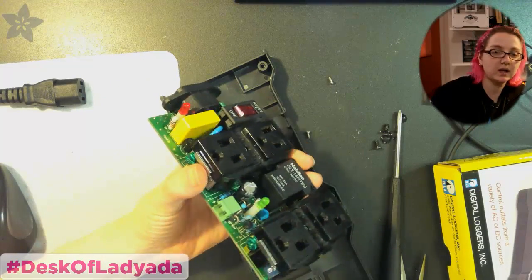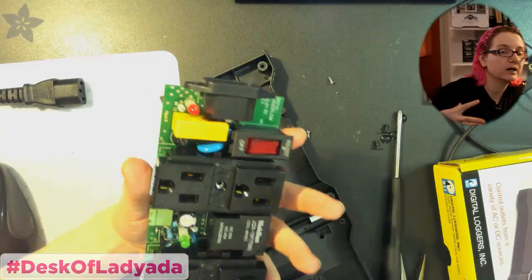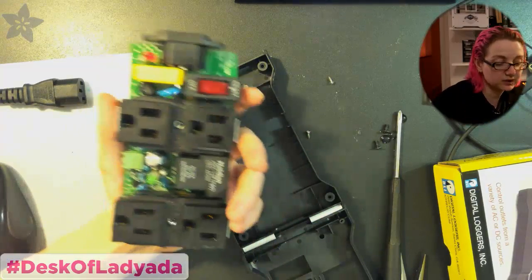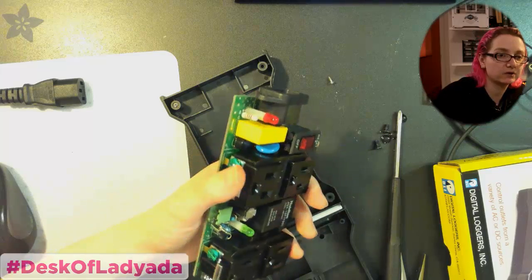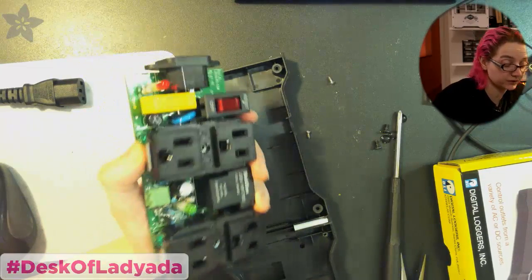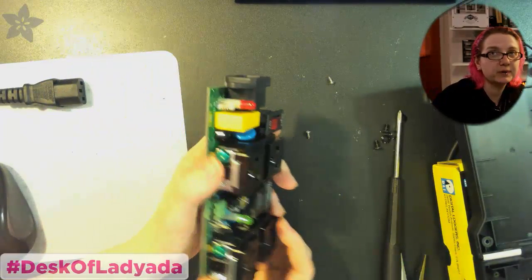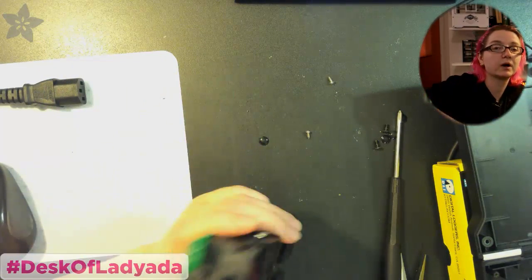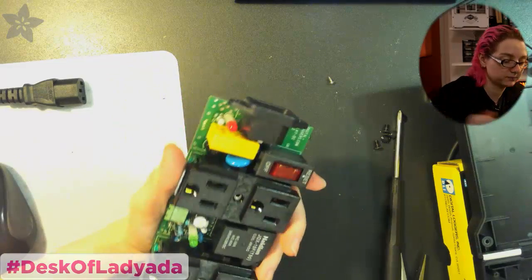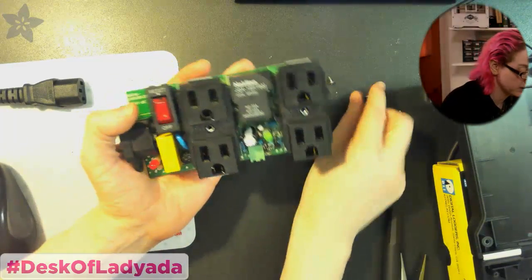I've seen a lot of projects that just have a suicide cord, basically an extension cord, cut, spliced, and connected to a relay. And it's very easy for a wire to come loose. And in this case, the only wire that could come loose is a low voltage wire, which is fine. It's unfortunate because your project won't work, but there's little risk of a high voltage wire coming loose and then shorting out to something else, either damaging it or damaging a person.